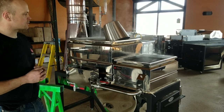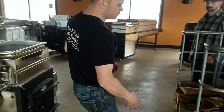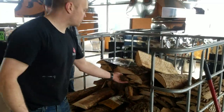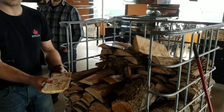I run things pretty hot until I have about 15 gallons of sap. At that point, I stop throwing in big, huge wood — this piece is too big to ever throw in, but sometimes we do if it's in our way. As I start shutting down, if I'm down to 15 gallons, I'll stop filling the fire box so full and fire only with smaller stuff.